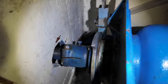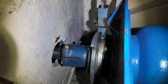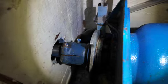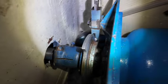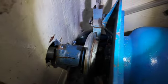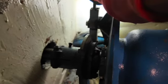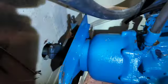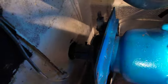It was designed, I think, in the 70s or something like that, and the previous owner, or the one before him, sheared that thing off. So now I'm just trying to reinvent the wheel a little bit here. I got this attached back. This is what will stop that. So it's catching on the blade that's below this one that you can see. And it's attached there. The idea is to put another one here and then have it hinged so it'll push that one and create tension there.